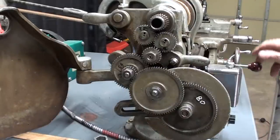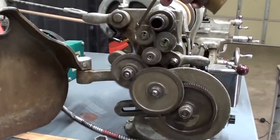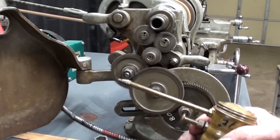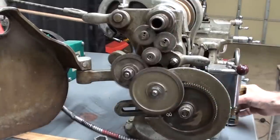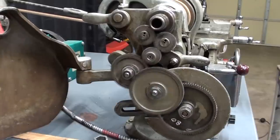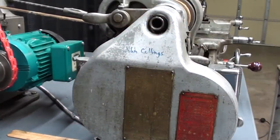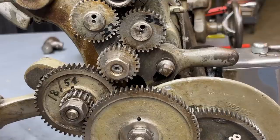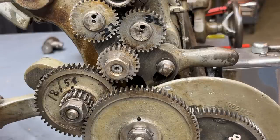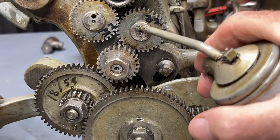Let's see if it works. Don't get the tip of your oil can in there — all of the oil cans at the high school had mangled tips. There are no strange noises, no howling, no clicking — I'm pretty satisfied. Always close the guard if you like your digits. Now let's set it up and proof it to see if we have about three thousandths feed. Do not forget to oil each gear because you're oiling the shafts they are riding on, and do that on a regular basis when you do your other lubrication.